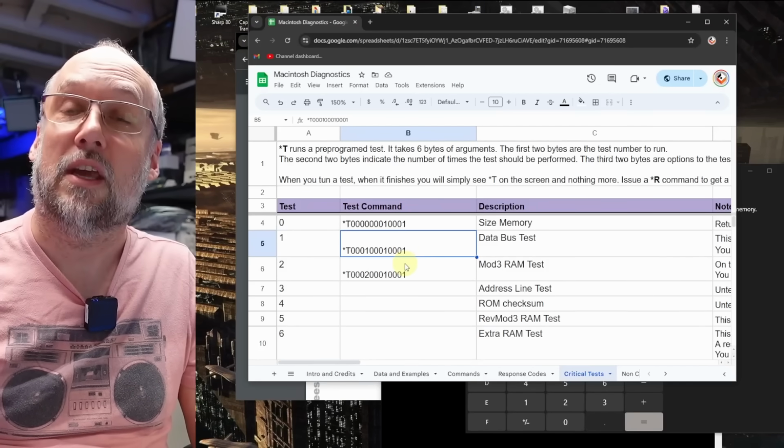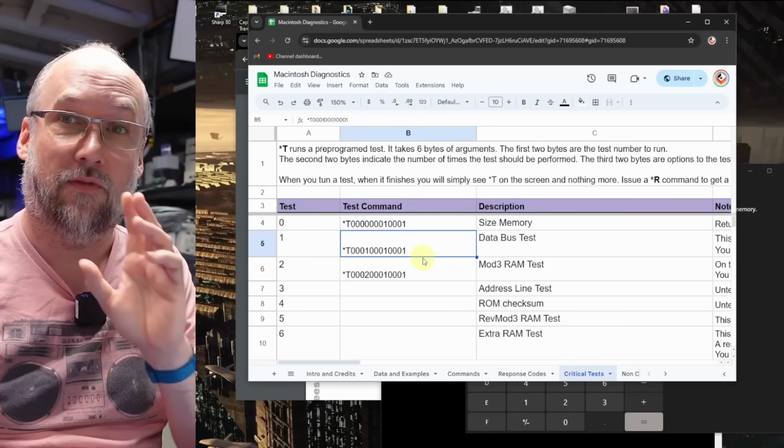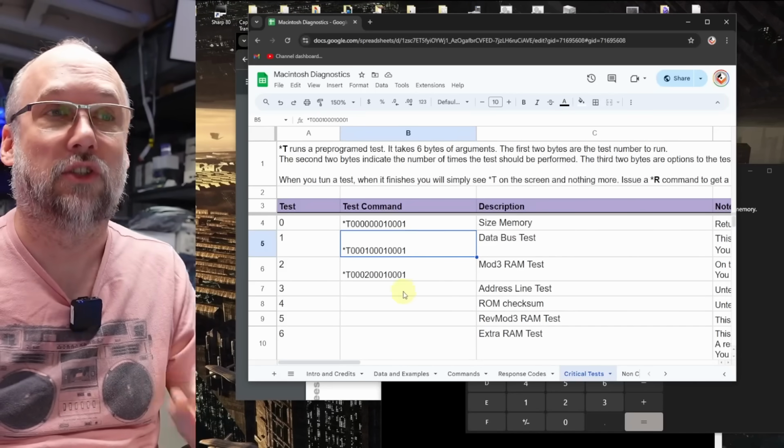We're still gathering evidence on what's wrong with this machine, and I think it's too soon to jump to any conclusions on what might be wrong based on the 2 diagnostic results that we're seeing. We're seeing the initial power on data bus failure of those first 24 bits, and then we're also now seeing that it's not sizing the memory correctly. What we need to do though is to keep gathering evidence about what the symptoms are on this machine so we can actually form a proper hypothesis of what might actually be wrong.